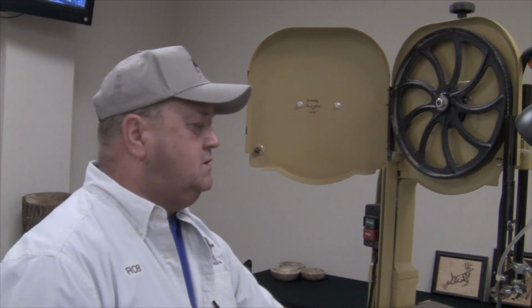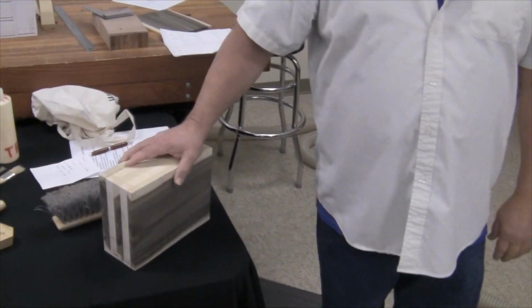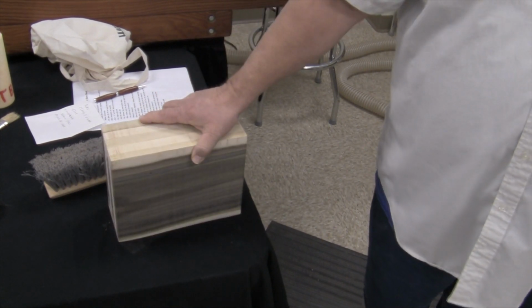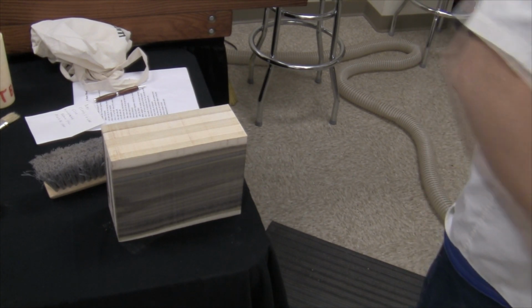Well, that's true with any of the blades. The wood slicer that they sell from Highland Woodworking works beautifully if you're cutting wood that's been kiln dried and is all ready to go; you have no trouble cutting it. But the first time you make a twist on it, like you were trying to make a curve, you'll never get that blade to work right again. So it's going to be fine as long as you ever use it. I've got a 3/4 inch for that, and I thought it was great, but I can't use it for anything else, so I don't bother putting it on.